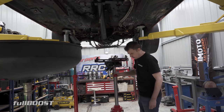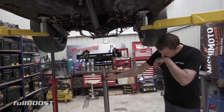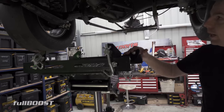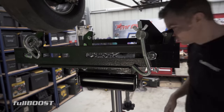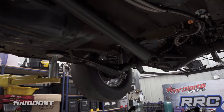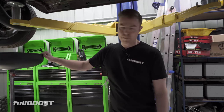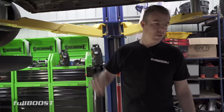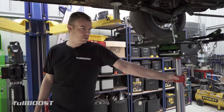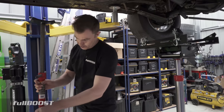There is a transmission in this car, and the best way to get the driveline in and out is with a transmission jack — essentially a giant jack with a base plate and chains you can wrap around a gearbox or differential. A Hilux diff is super heavy, and a Turbo 400 or big manual gearbox you're not hoisting into place without doing a shoulder or back injury. These put them up, hold them there, bolt them in — and the best part is it becomes a one-man operation, which is really important when you're working by yourself 99.9% of the time.